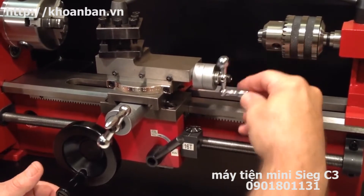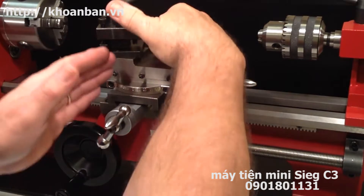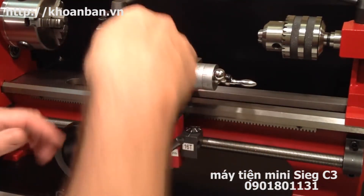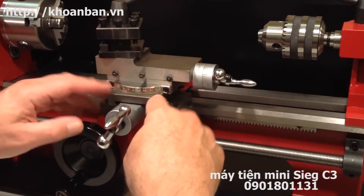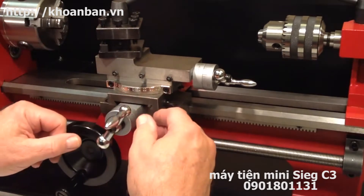The compound can be rotated — there are some screws underneath that can be loosened and you can set the angle of the compound anywhere along a 360-degree arc to achieve compound cuts such as a short taper or a bevel on the end of a workpiece.